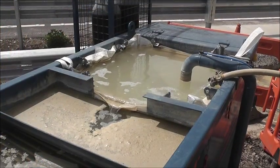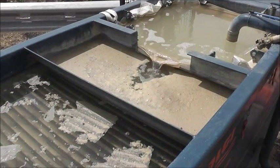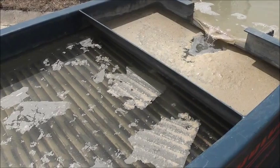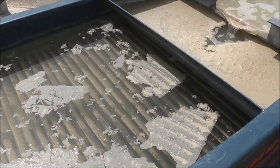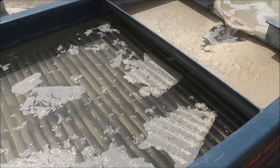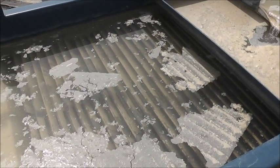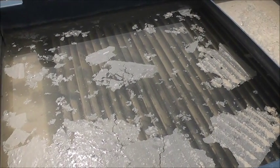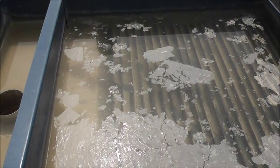The hydro demolition blast water passes through a specialised geotextile bag to capture the gross solids and undergoes pH adjustment. It then weirs over into the unit's lamella clarifier, where any fine particles precipitated out during pH adjustment are allowed to settle. Any light floating precipitated particles are also retained before the crystal clear, neutral pH water flows over the unit's outlet weir.